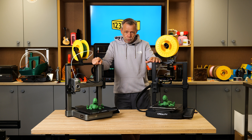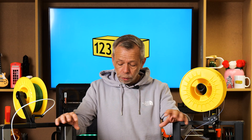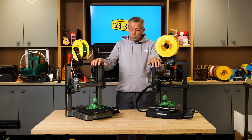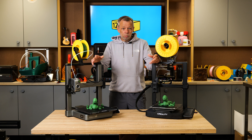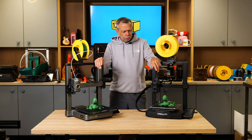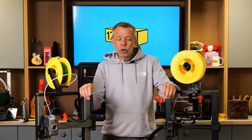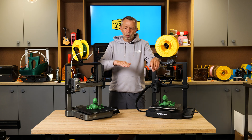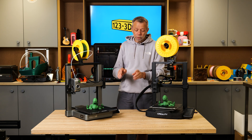We've used both of these machines — the KE for a lot longer. They are very user-friendly, especially for beginners, pretty much plug and play with minimal assembly. If you're using Creality Print — other slicers are available — the profiles for either machine are very well tuned, so you don't have to tweak anything. You simply select your filament material type, slice your file, send it to the printer, and it prints. A couple of tweaks I do suggest: the Z-hop was a problem out of the box — it was set a fraction too low, causing the nozzle to collide with the print when traveling. Adjust the Z-hop in the slicer settings by a couple of millimeters — that alleviates the issue.